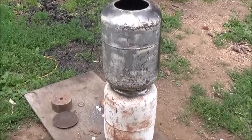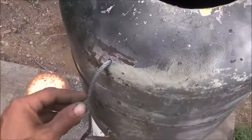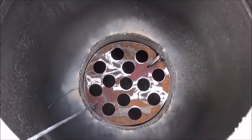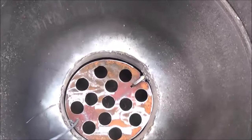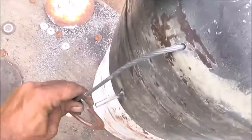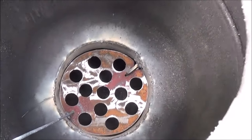I've got the upper and the lower now able to sit down inside of each other. The screen is finished — you can see the cable coming off of it going down to a little peg that holds the loop. If I unhook the loop and show you down inside, all I've got to do is give it a shake and we can clean the screen. You probably only want to shake it just a little bit to get it going. Then you pull your loop down over that peg and it holds it there, and your screen's shut.